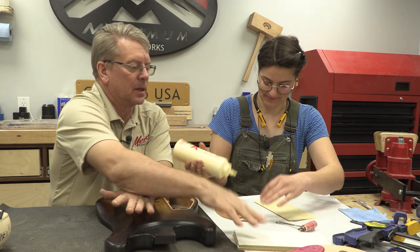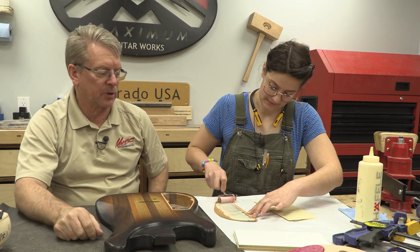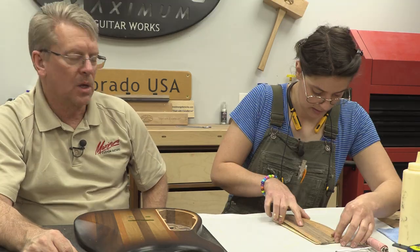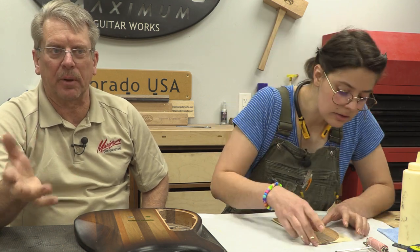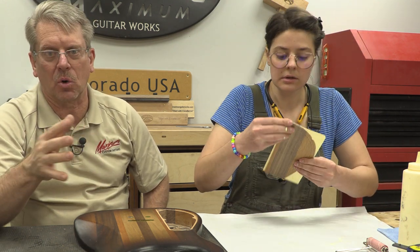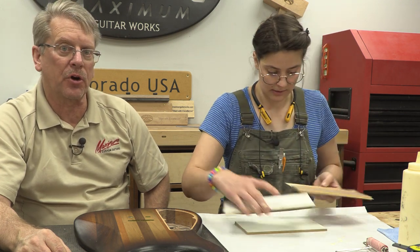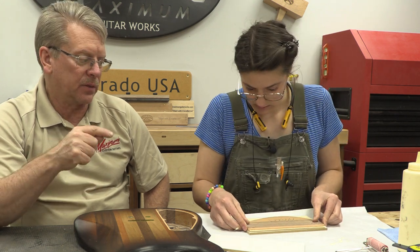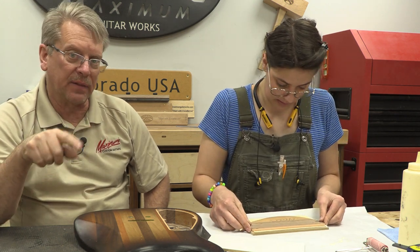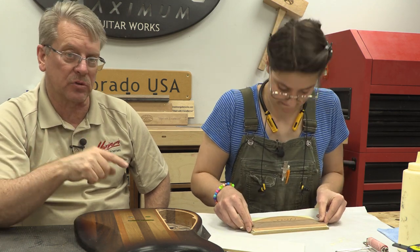Yep. So that's what we're going to use so we can avoid the wax paper, but wax paper certainly is a good way to go. When I cut it out, I left at least 1/8, but more likely closer to 1/4 inch all around the edge. So we don't have to necessarily get it perfectly aligned front and back. The key thing is the front side and the lines that we drew is where we're going to match the template up after this glue dries.